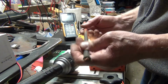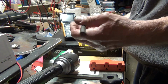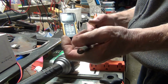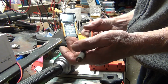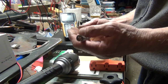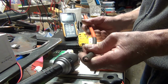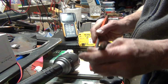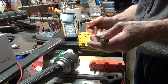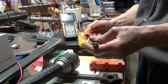I'm just saying, all of these cables are from welding supply, and they've been used for stick welders. If the cables go bad, this is just a replacement for the cables, and those machines, they use very high amperage and pretty low voltage. So these are like the really best cables for the inverters, for the DC side, from battery to the inverters, or even connecting the batteries in parallel or series.